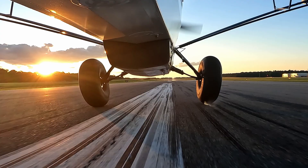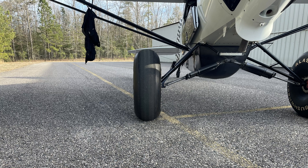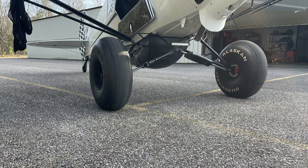Looking at my last video, you can see the angle of the tire at first contact — that area where the cord is most likely to show as the tire continues to wear. I decided to go with 16 PSI, and after rotating my tires two weeks ago I'm actually running closer to 18 PSI. I'll show a picture of what my tires look like at this pressure. Keep in mind that if you're running below the posted sidewall tire pressure, you're in unknown territory as to what your tire will hold up against. If you're running below 8 PSI, you may want to check with AK Bush Wheels about that.